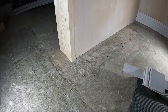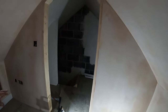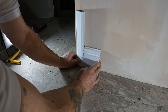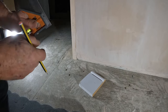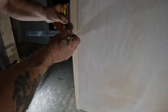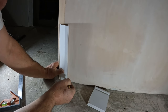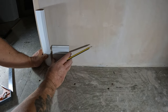So our next section — if we take a little step back. I've got a skirting at the bottom there and we're going to put architraves around the top, so that's a little bit more intricate. We'll show you how we've got to do the detail. In effect, that's got to fit like so, and that's got to fit there. To get the length of this, set this up first. I've set my square up at six mil, and basically I'll mark that like so — mark that all the way around. That will sit at that point. See that pencil mark there and the pencil mark there — that's got to sit like that. And this will go there. So that's our length. We've got to cut a scribe that end, and we'll cut a straight joint this end, so that'll go like that into a scribe there.